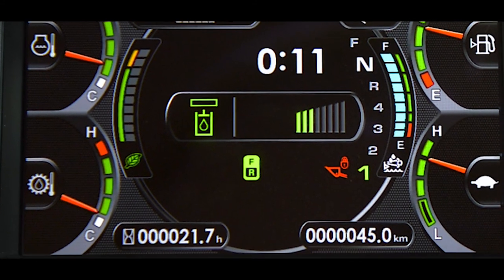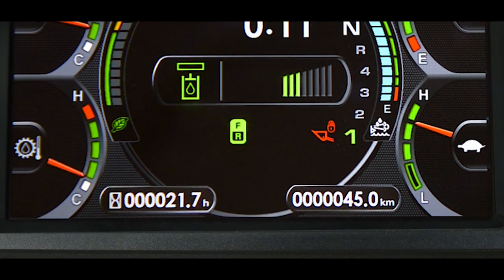At the bottom of the monitor display, there are two user-programmable meters. The left meter can be programmed to display service meter reading, or SMR, in 12 or 24-hour format — the SMR is the default. For the right meter, the choices are average fuel consumption (the default), SMR hours, odometer, or clock time.